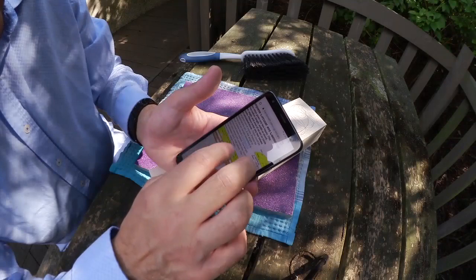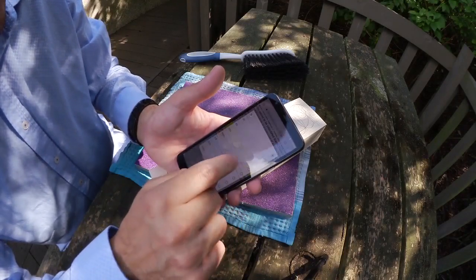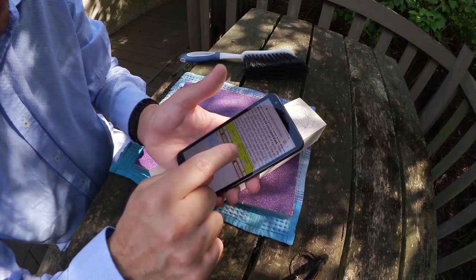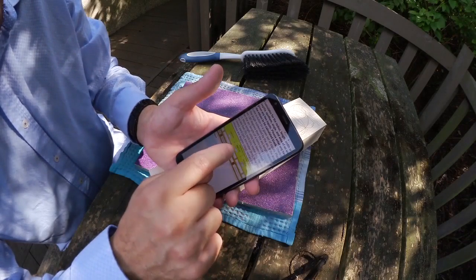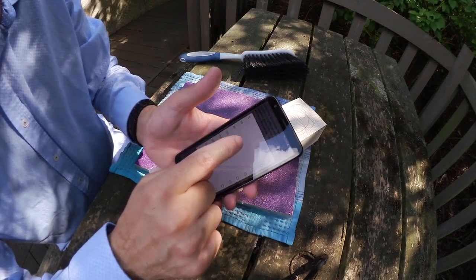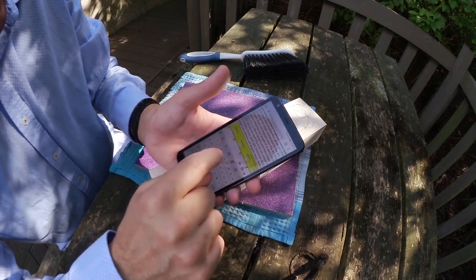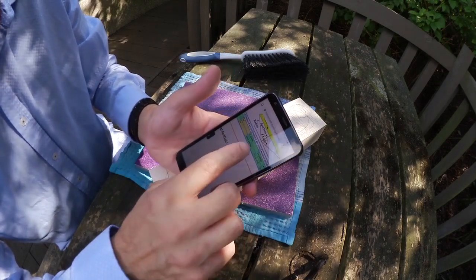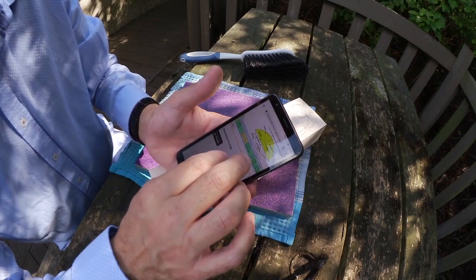The width of the arc is the length of this plate in this case, which would be 12 inches. So we're gonna put in 12 inches. And then the height of the arc, we're gonna put millimeters in. That's what's gonna be what's reduced from the wood. And the radius of the arc, let's say it was 7 meters going the long way. So we'll put 3.5 meters. The height of the arc is 3.3 millimeters. Ooh, that's a lot, isn't it?